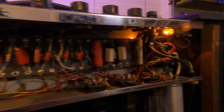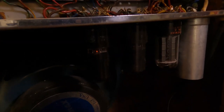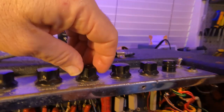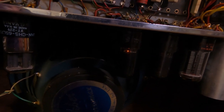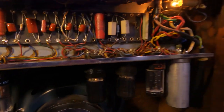At 180 volts, things are coming to life now. I'm hearing a pulsing — I suspect that means our vibrato is on. We're hearing a bit of hum, and sure enough something is oscillating. We've got a few things there to look at. So that hum is making me think we're going to check the capacitors, in particular the health of this cap can.